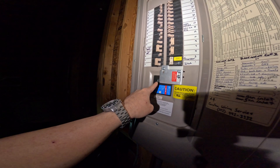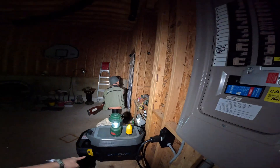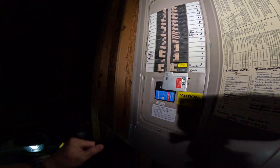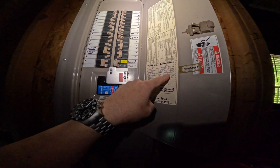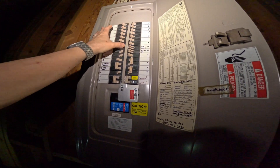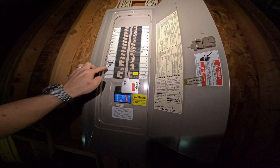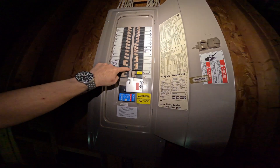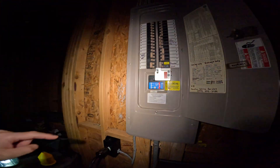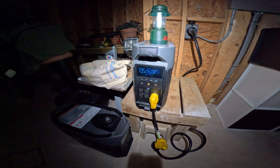That automatically slid on. Now I will turn on the interlock, and this will test my EcoFlow to see if it'll power the chosen ones — 13, 17, 19 — I want to run. So let's try turning everything else off. So all of these are off, and just the generator inlet is on. There it goes.